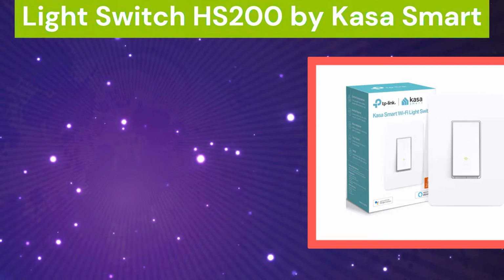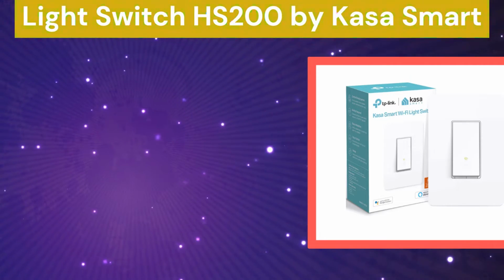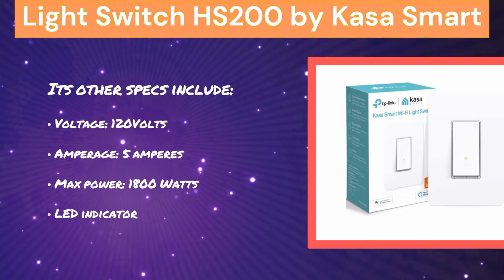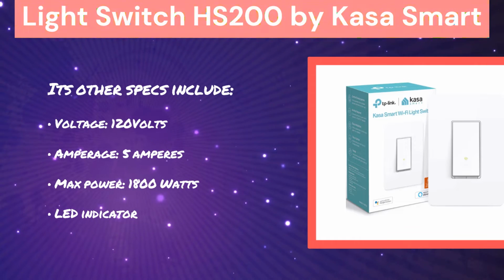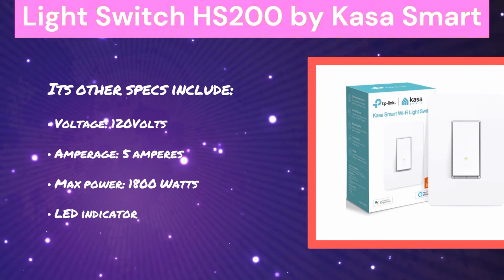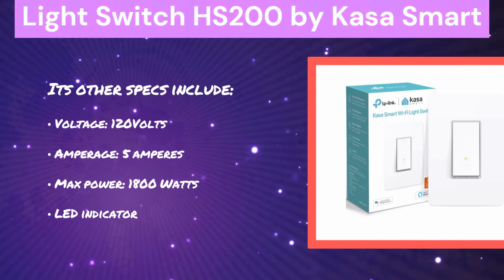When installing the Kasa Smart Light Switch HS200, you will need to make sure the light switch you're replacing has a neutral wire. Its other specs include voltage, 120 volts, amperage, 5 amperes, max power, 1800 watts, LED indicator.